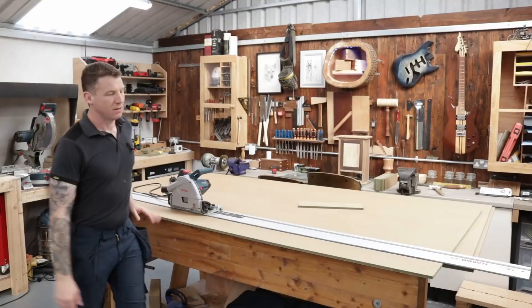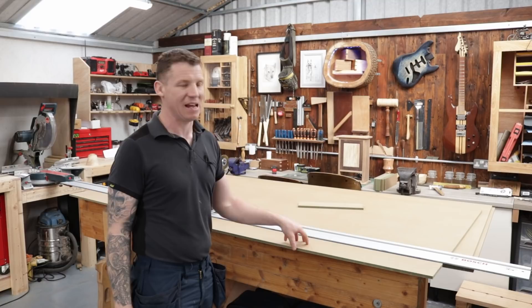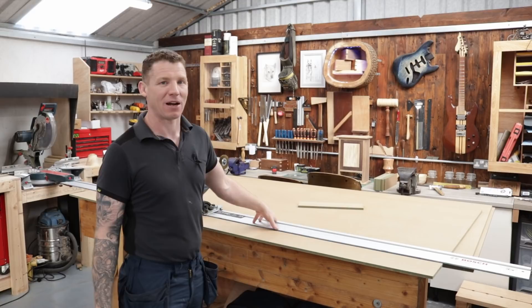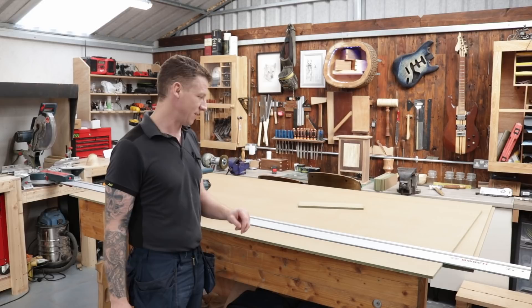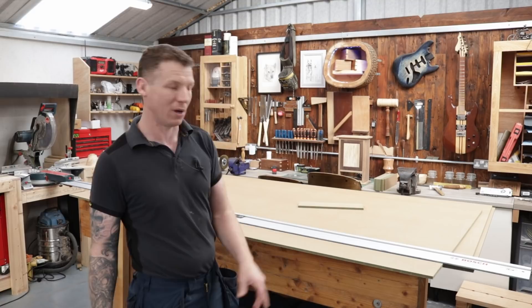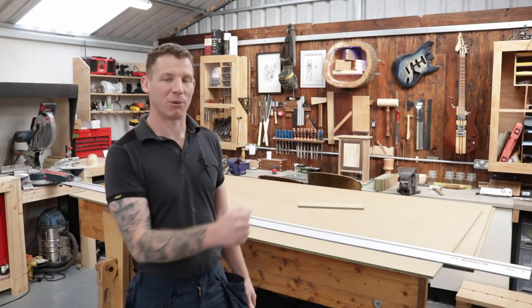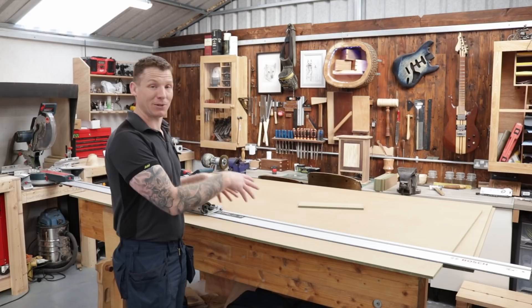This is what we're going to be using. It's half-inch moisture resistant MDF — this is what all the kits sold online are made out of. It takes no time at all to make your own and you can make it look like anything you want. All you need really is a router and possibly a track saw — it makes breaking this stuff down so much easier, literally takes minutes. You can even make this look like tongue and groove slats on the wall just by running a straight line with a V cutter on your router. It's nice and easy to paint, just stick it to the wall with a couple of brad nails and some adhesive.